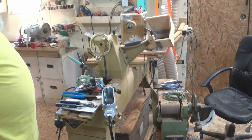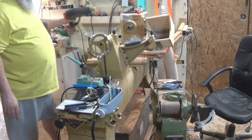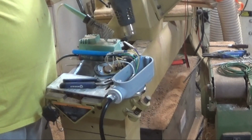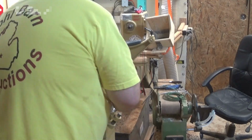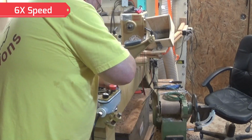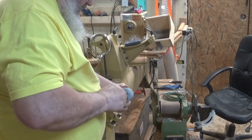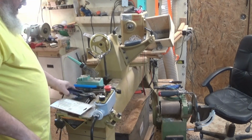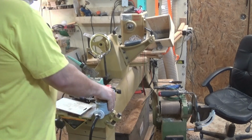All right, all the connections are made. That heat shrink is good stuff. Now those are nice and insulated. I won't have any problems with them. And that's that. Connected, they're insulated, no chances of shorts. You don't have to gorilla tighten this, just get it snug to keep the air out and the dust. Now, what we do need to tighten pretty good is this compression fitting so that the wire doesn't slip back and forth. And you know it's tight enough when it starts twisting the wire. That's not going anywhere.